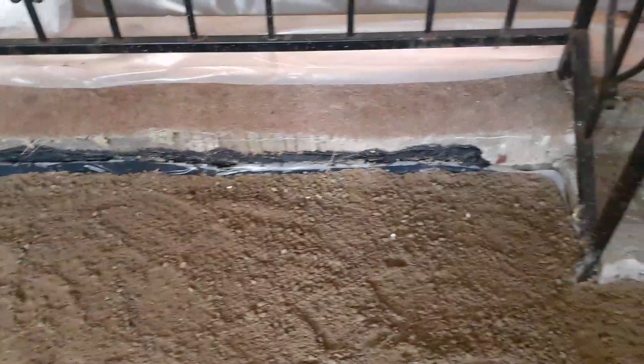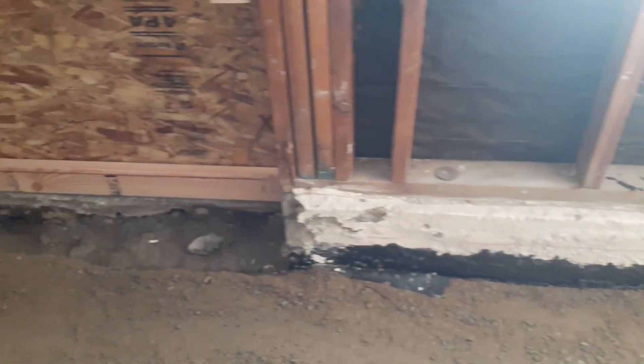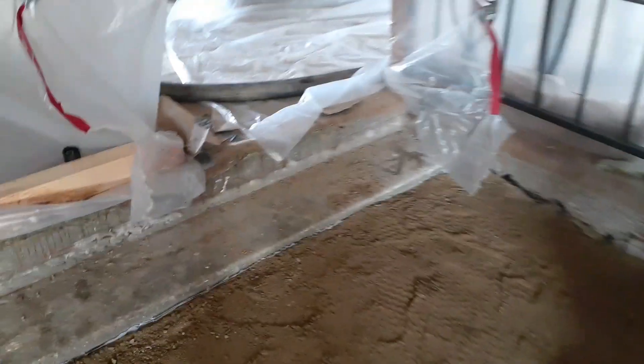This is the area — we have four inches of gravel and sand in here. As you can see, there's a barrier of plastic, and we put tar around the base so in case there's ever water coming through to try to fill this room, we'll be able to handle it. She's raising the floor level because they're getting older and the steps are too much.